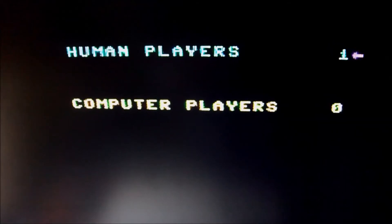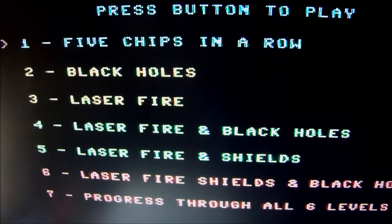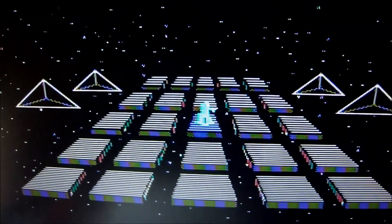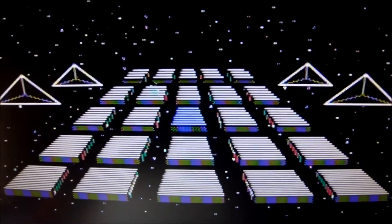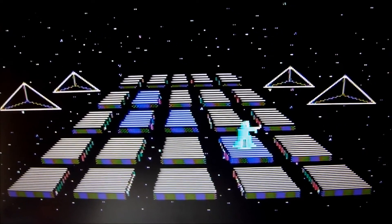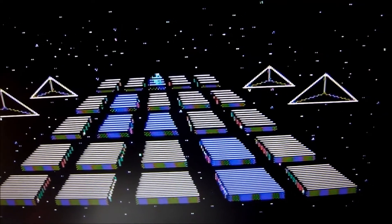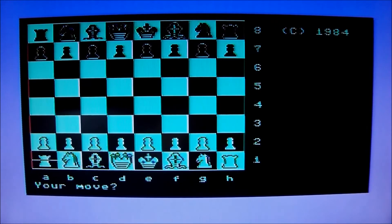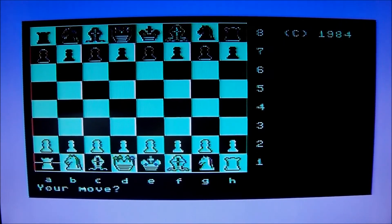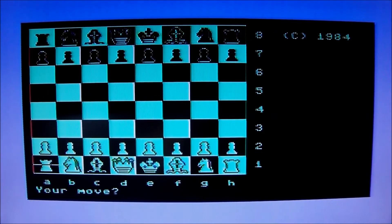So far so good. Lessons learned: if you ever get a new cartridge and want to quickly find out if it looks okay, first take a look at the contacts to make sure they're clean. The second thing is to check the sequence of the contacts — one, skip one, two and three tied together. Very quickly, at a glance, you can tell if it's not upside down inside the plastic box. There is a rational explanation: pin one from the Commodore side is ground, so it needs to be there at all times; two and three are plus five volts and should also be there at all times.